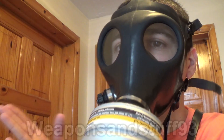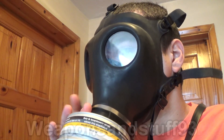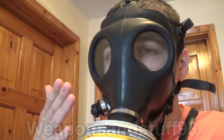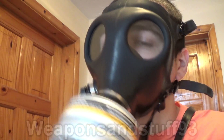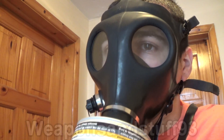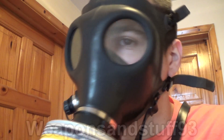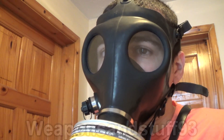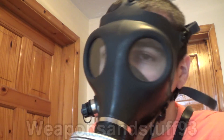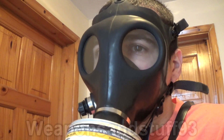Get into a confined space and spray some really strong chemicals. If the filter is not working, if your mask isn't airtight, or if one of the seals is broken, you will smell that smell. If you can smell it with the mask on, you know the mask or filter isn't working. Then try a new filter for process of elimination — if you go through several filters that should work and you can still smell it, you know there's actually a problem and you need a new mask.